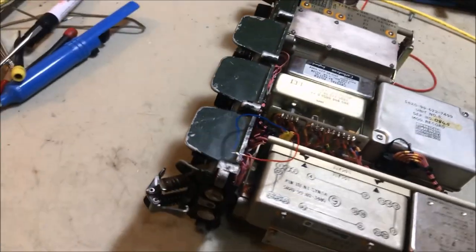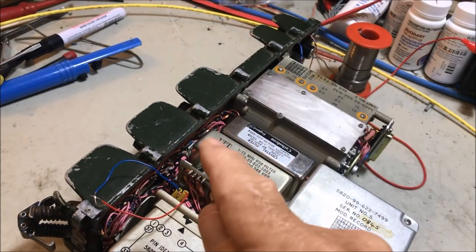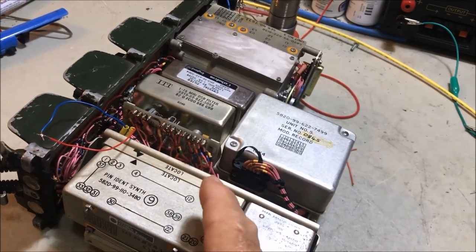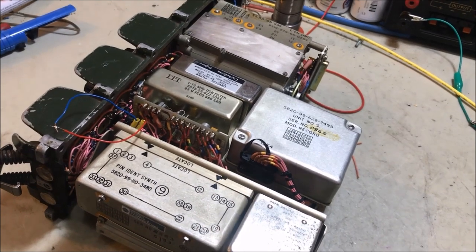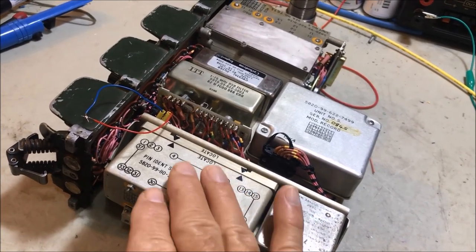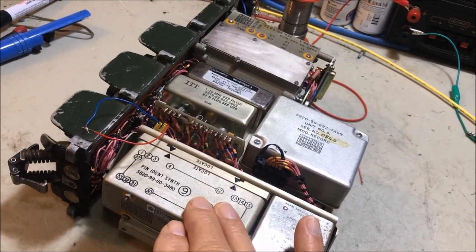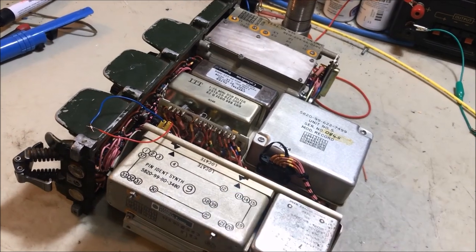Okay, now not only that, I've got to remove all the decade switches. I've got to remove all the wiring from the decade switches that comes back to the synthesizer. And after I get all of that debris out of the way, I'm going to look at all the wires that are left on the synthesizer, and I'm going to identify them, especially the power supplies, the earths, and the 110 volts, etc., etc. Because all of those are going to be significant, and they're going to be used in a different way. So this will eventually be completely removed. The wires will all be identified.